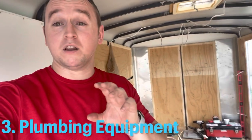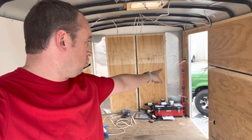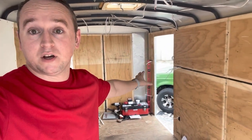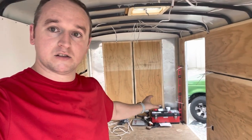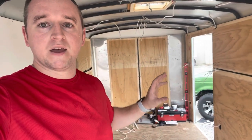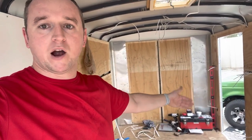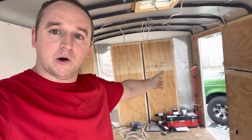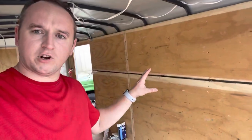Finally, the plumbing equipment. Compared to the electrical it's a little more straightforward. I'll have my three-compartment sink at the front of the trailer plus a hand sink on this wall to meet health code regulations. Underneath the trailer I will have my fresh and gray water tanks mounted to save space — we only have a limited amount of space in here. We'll build drains on the underside to carry the gray water out and an inlet to fill fresh water.